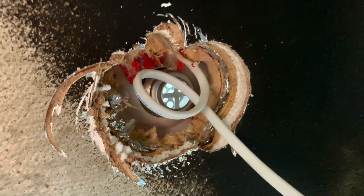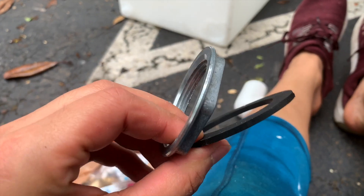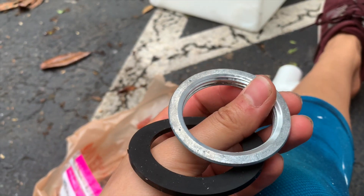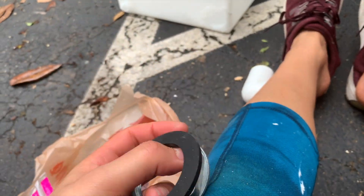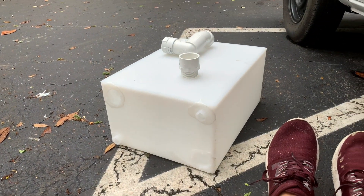This is my hole — that's the drain. Initially I drilled a two-inch hole thinking that was the size of the drain, because it matched the drain hole on the shower pan. But I didn't realize I needed to leave enough room, because your drain comes with a gasket and a nut, and you're supposed to tighten it between the shower pan so it stays.